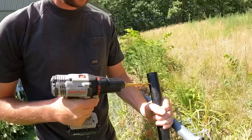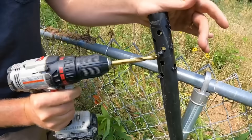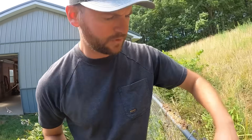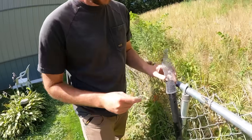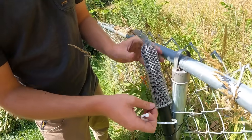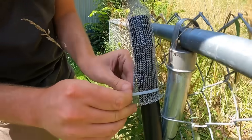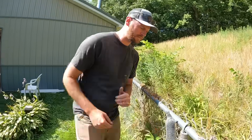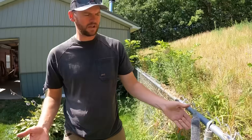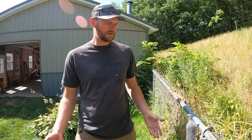We're going to go ahead and drill some holes in here now — just want to make sure we've got plenty of room for water to get into the pump. We don't want it to not work because there's not enough water going into it. If the end were to get plugged, it still has room for water to get in around the side. This will be a maintenance item — something we've got to keep an eye on once a week to make sure nothing got plugged in the pump. No energy cost involved at all, assuming it works. I think we're all set up now. Let's head down to the creek and see if it pumps water.